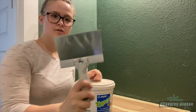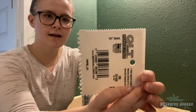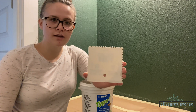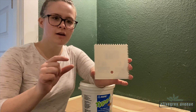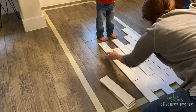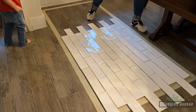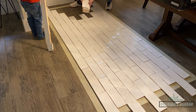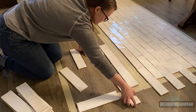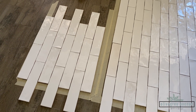The tools I'm using today are type 1 tile adhesive, which I'll spread with a rubber float and a V-notched tapered straight edge. There are three sizes of teeth — you choose between different sizes depending on the tile size you use, so you can make bigger or smaller notches for mosaic tiles or larger tiles like I have. Before getting the tiles on the wall, I laid out everything on the floor by taping out the exact dimensions so I could plan my pattern and confirm I had enough tiles. I briefly tried another pattern but quickly decided on vertical subway tiles.